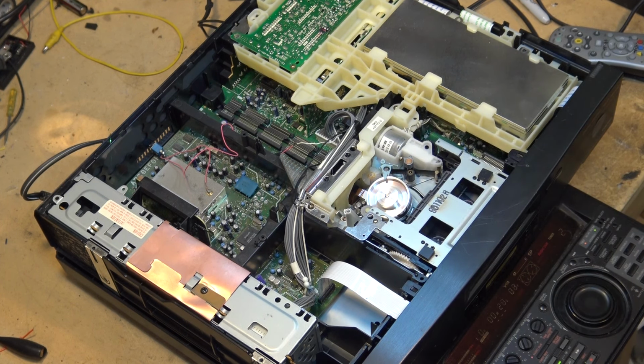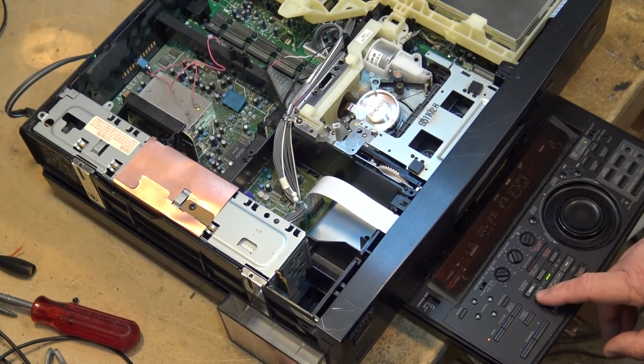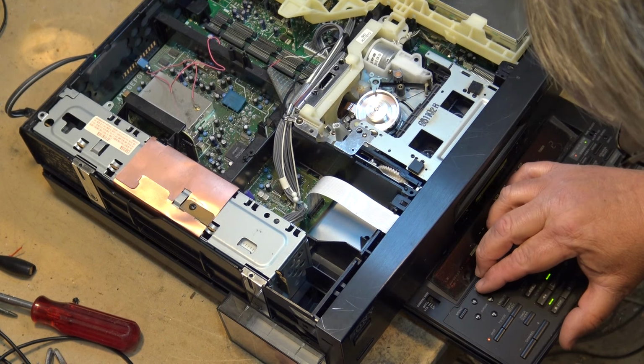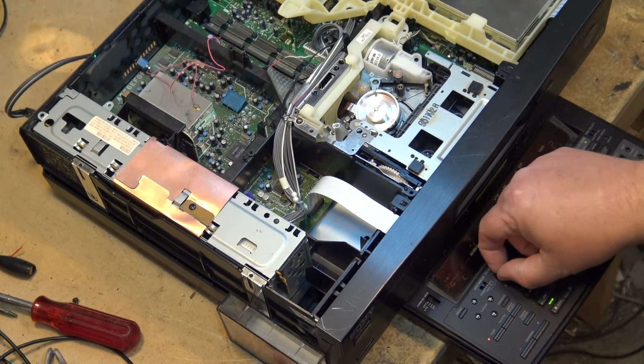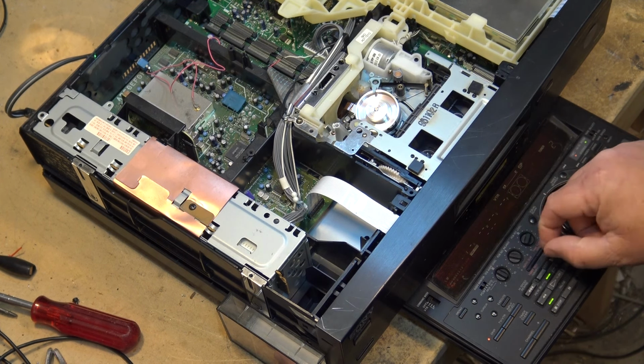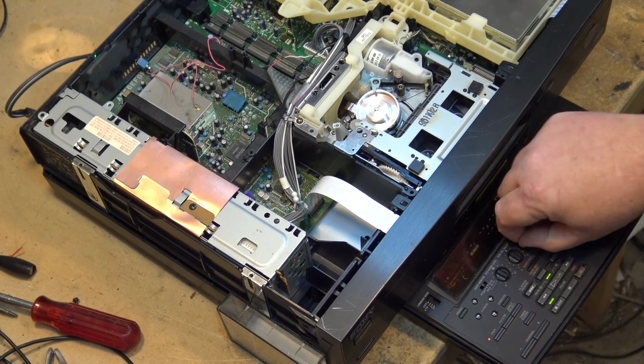So you could audio dub and then play the tape back. I'll stop it, and go back to where I think the audio dubbing starts. On playback, it should tell me here PCM. If I switch it to mix, now you've got a control here, your PCM record balance and PCM record level, so you can set your levels and fade music up and fade it out.